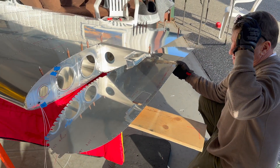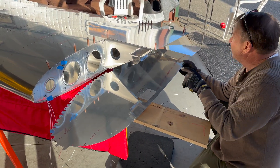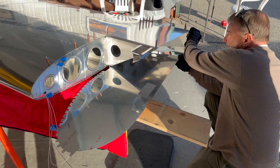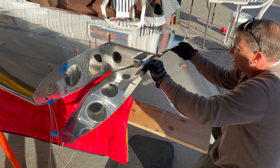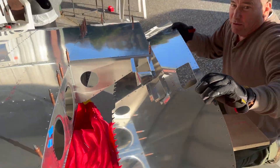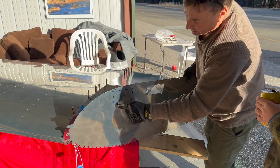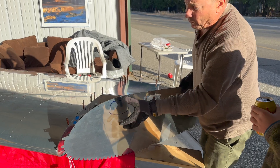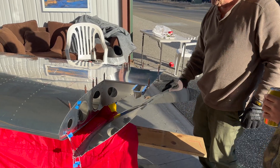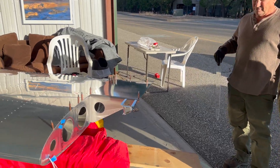Like the rest of it, it's just kind of flown together. We'll have to figure out the angles — the instructions tell you exactly what angle to put each of these flanges to, to rivet it on up together. There'll be a fluted angle piece in here that this will rivet to. But here's what we've got to do: if we're going to put that lighting kit in, we've got to cut a hole here — that's where the strobe light and nav light will go, right into that little fiberglass piece. So a bit of fabrication on this wingtip.